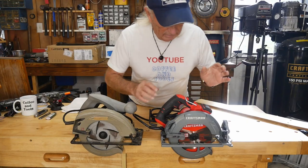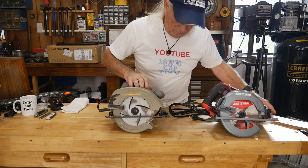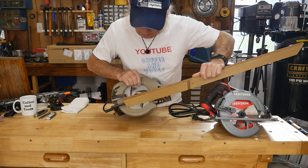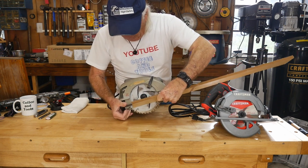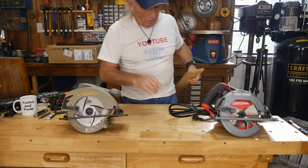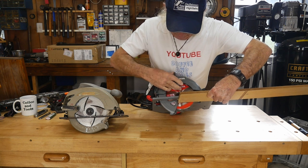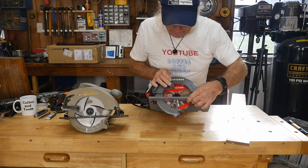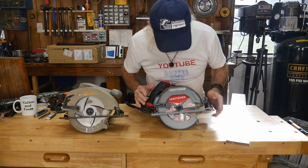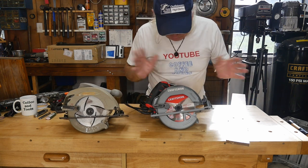First thing I noticed: this is an old issue. If you've been using a circular saw and you're cutting a board, you can get hooked into the guard — even though the guard should be following the lumber through the cut. I've gotten hooked into the lumber many times with the old saw. The new Craftsman apparently gave this some thought — they've added a little tongue here on the guard so it rolls right past and you don't get hung up. That used to really screw up a lot of work for me over the years.